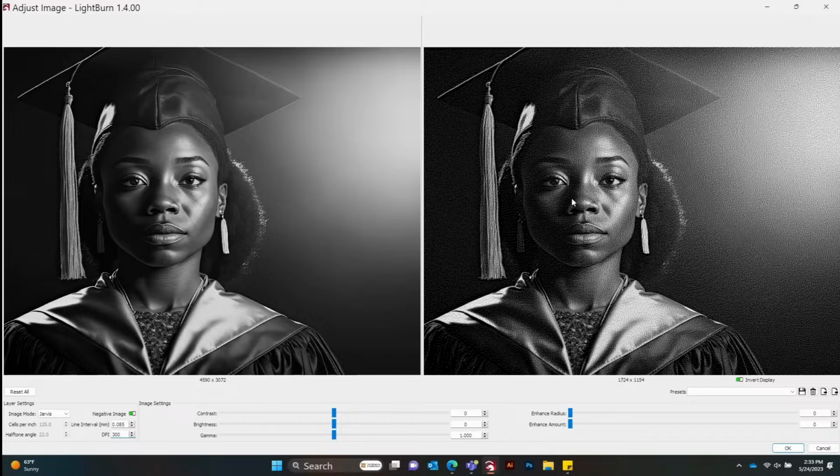When we're printing onto granite, it's kind of like a dot matrix printer or printing a newspaper. We have to use dots to get our definition. But if we blur out all of the dots, we just have a blurry mess. And that's, at the end of the day, what's going to happen. That's when I talked about the science in the beginning of the video. If you didn't catch that beginning, or if you want to go back later and listen again, I explained the science of how this is working. But that's why you just don't want to overexpose. It just exposes the stone more, and we want the detail in the image.